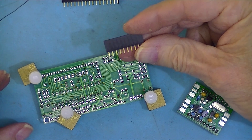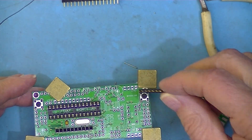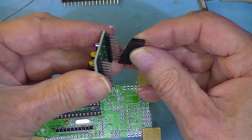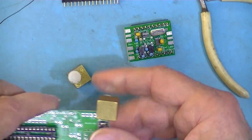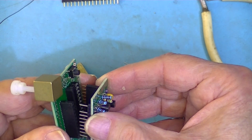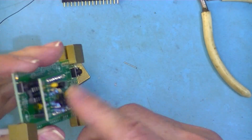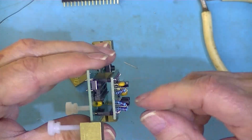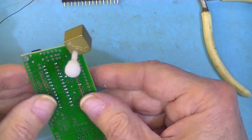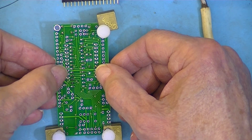There are two 10-pin header modules — one here and one over here. One way of making sure they're installed correctly is to attach them to the synthesizer. I've already tacked one in here. The synthesizer module — I think I have it plugged in wrong, but since it's just a spacer right now it doesn't matter. We're going to take this back off, but in order to align these headers and make sure they're perpendicular to this board, just install it that way. With the synthesizer board installed, just go ahead and solder 20 solder joints.